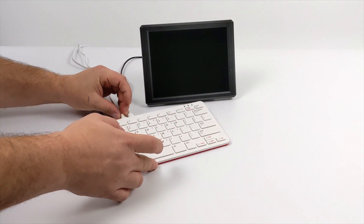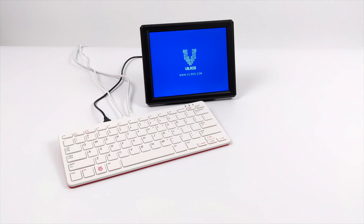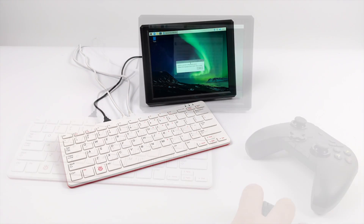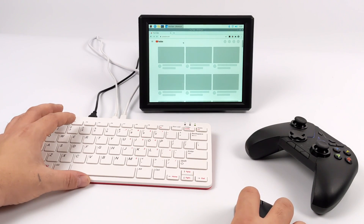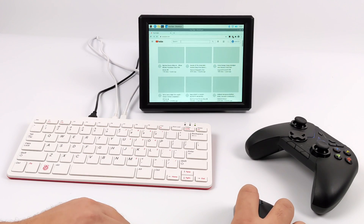I'm using an official Raspberry Pi USB Type-C power supply, and there we go. I'm going to let this boot up — I'm pretty sure we'll have enough power from one of those USB 3.0 ports on the Pi 400 for this screen. Yeah, it's actually looking good. I need to put a load on the CPU just to make sure it doesn't dip the power on that USB port enough to cut the screen off, but I think it'll be fine. No issues so far — we're going to head over to YouTube and see what happens.